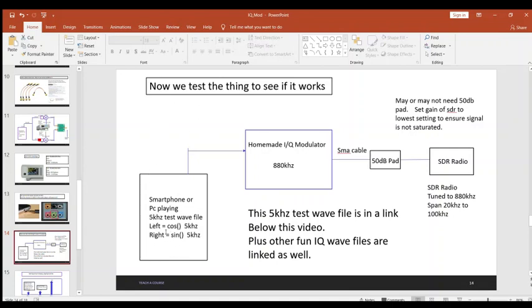What I found is, you play this 5 kilohertz test file. And this WAV file is in a link below this video, as well as a whole bunch of other WAV files that you can experiment with. The idea here, folks, is that on the left channel we're playing a cosine signal, and on the right channel we're playing a sine, and they're both 5 kilohertz in frequency. We're feeding those two signals into our homemade IQ modulator, and it's going to come out at 880 kilohertz.